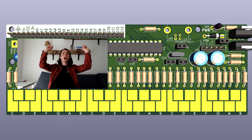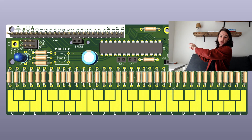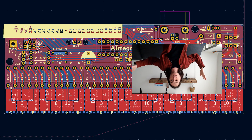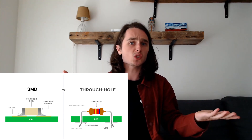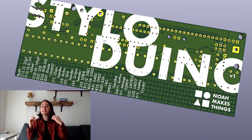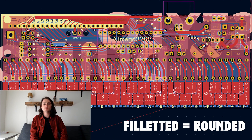Now that you know what it all does, let me show you what I've made. Everything fits on this board, which is nice and pretty compact. We've got our IO up here, our keys down here, and our glorious ATmega in the middle. And a USB Type-B precariously dangling off the edge. You might notice that all the components are through-hole components — that means they go through a hole. That's because I've assembled SMD components by hand before, and I'm interested in enjoying my life. I also silkscreened the bill of materials on the back, because I need to idiot-proof this for the moron who will be assembling this. And being a mechanical engineer by training, I filleted all the traces for better structural integrity and to reduce electrical stress concentrations.